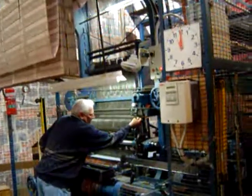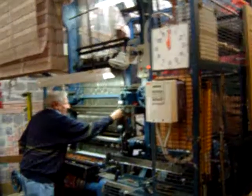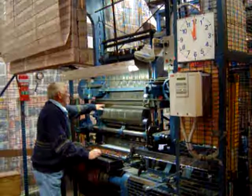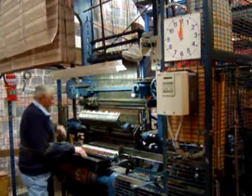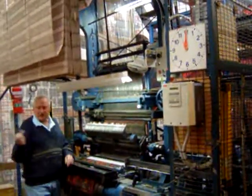It's called my knife, and my knife fits in there. You can see the one that's already there? A backing plate, a tension spring, and a wing nut. So we fit in behind that backing plate. It runs across that blade and cuts our yarn. There's our yarn cut at 3/4 of an inch, and it's all done by a simple sharpened piece of steel.